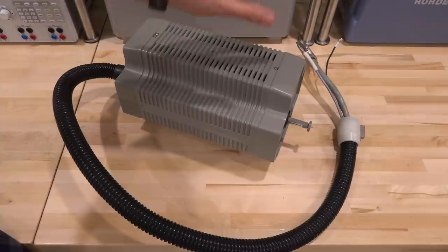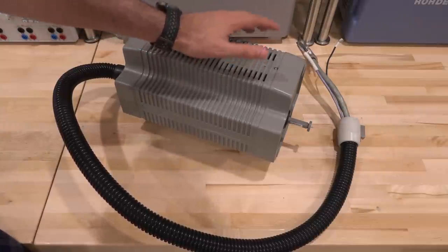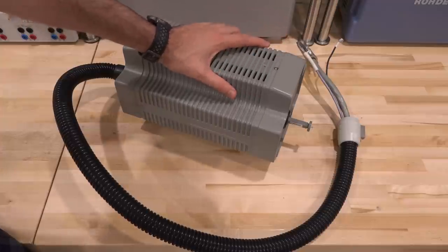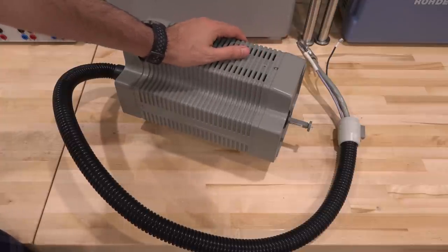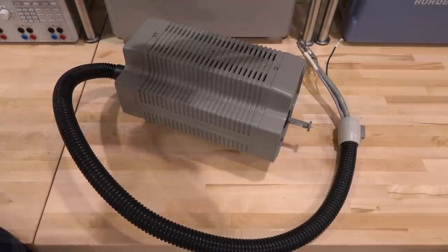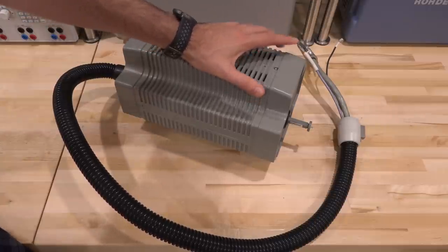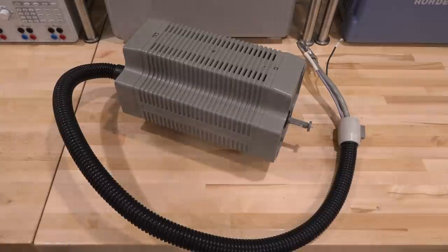Without a millimeter wave controller it's going to be hard to use this, but I'm going to try and see what we can do. I want to take it apart, show you what's exactly inside, what kind of stuff is used, how you even build one of these, and how you make S-parameter measurements between 75 and 110 GHz by adding these to an existing network analyzer — in the case of a HP 8510. There's a lot to talk about.